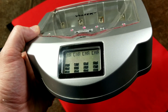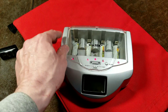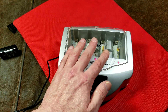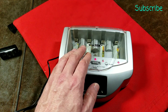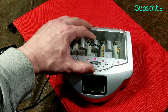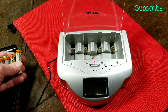I think those Energizer chargers I reviewed a little earlier are really much better than one of these. The one thing I can say about this charger is that the way they set up the electronics — in order to attempt to recharge an alkaline battery without causing fires — it's super voltage sensitive. It's really pretty strange because you can put a battery in this charger for maybe 10 minutes, pull it out, and if you put it right back in immediately, it'll think it's all the way charged. I've actually had these charging for a little bit and I'm going to pull them out to demonstrate that exact issue.